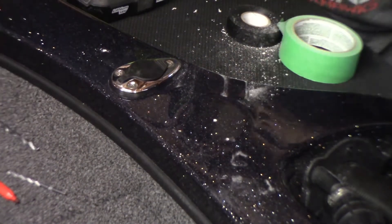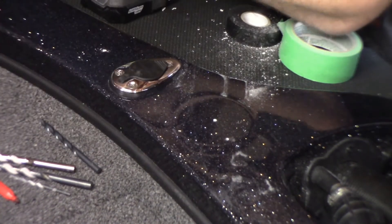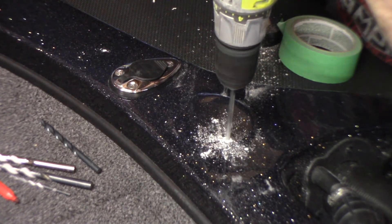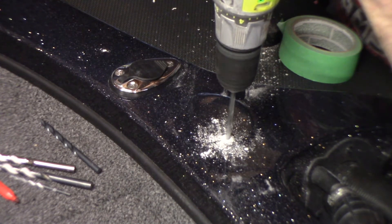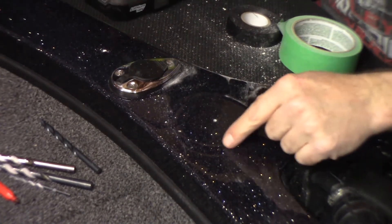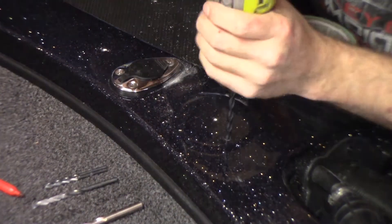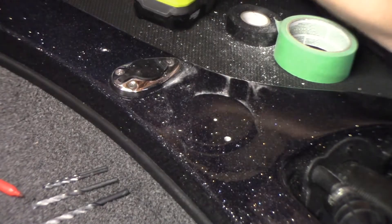I'm going to use a method that I feel keeps the fiberglass a little bit safer — I'm going to step up with my drills each time. Each hole I drill will be a little bit bigger than the previous hole up until the final size. Again, I'm going to start in reverse. I have the dark shavings coming out, and now they're getting whiter, which means I'm down into the regular fiberglass. I don't have any chipping around the hole. I laid out the drills in order. I'm stepping it up so that I don't chip the fiberglass as I go.